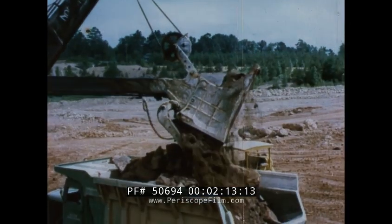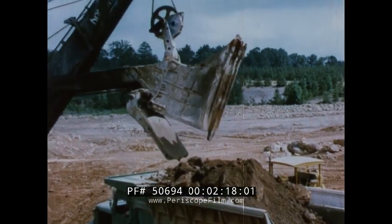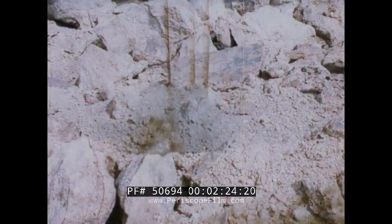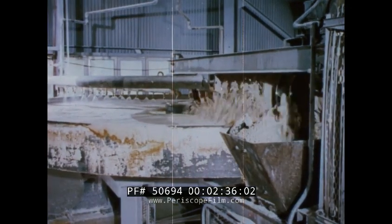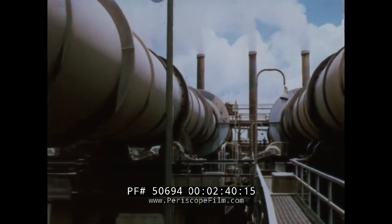Well, bauxite isn't pure the way it comes from the ground, so it has to go through the refinery. Before you melt it? Well, bauxite doesn't melt, no matter how much heat you apply, so we have to put it through another process, a washing process. Naturally, there's a lot more to it, but in the end, we have aluminum hydrate in suspension. After the liquid is drained from it, we collect it and dehydrate it completely in huge kilns which are constantly rotating. Flames shoot through from one end to the other, driving away the remaining moisture.